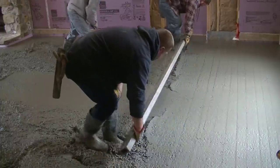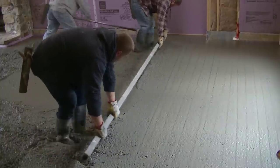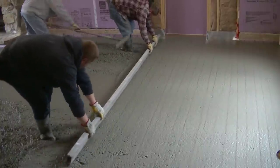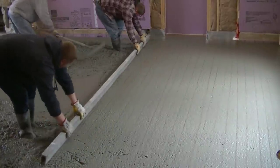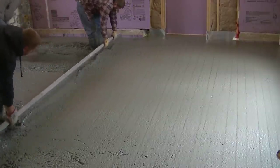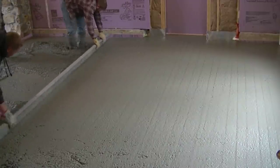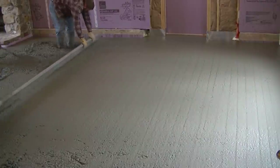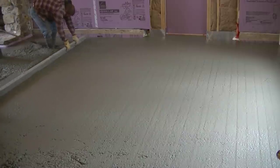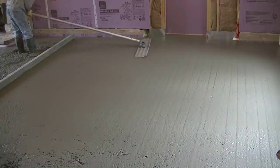I was the rake guy but I was making another pad, so I couldn't be in two places at once. The guys had to stop and fill it in — with only three of us we do what we can. Now I'm over there raking, the guys are kick screeding. We call this kick screeding: they keep moving, they don't stop, they keep that straight edge right on the back edge, don't cut with the front edge, and it glides right across the top over our wet pads. That's a 14-foot screed — two guys on a 14-footer can screed a bay down pretty fast.